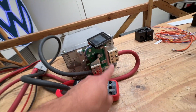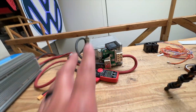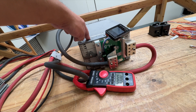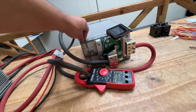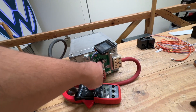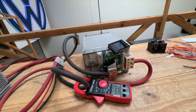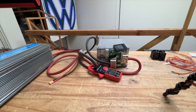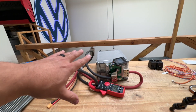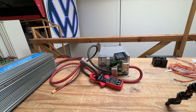You can put up to three of those and then a bunch of the smaller two. The reason why we're doing this is because these, even though they're electric car battery modules, if you use two of these modules, then that makes a 4S, which is 14.8 volts, which is really useful for car audio. Car audio people want 14.8 volts and they want a lot of amps. I think these ones could do somewhere around 600 amps without sagging much.